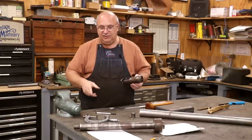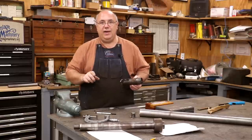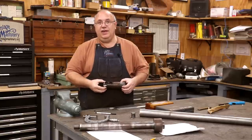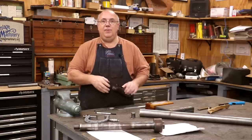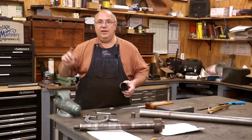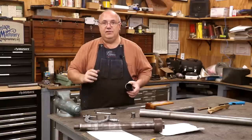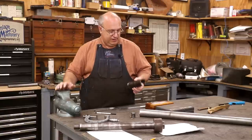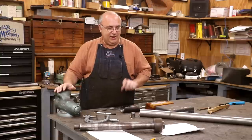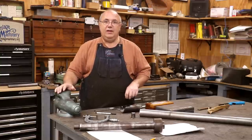The challenge is we've got to make that new taper and make it match the other one. Before we can do that, we need to do some measurements and figure out what the taper is. We also need some type of reference of that taper that we can use on our lathe to set the taper attachment to be cutting the proper taper. I've already done some measurements and some math, so let me get you guys caught up.